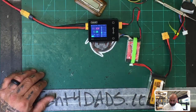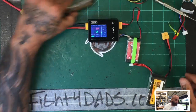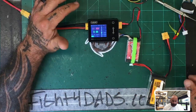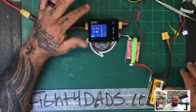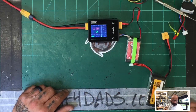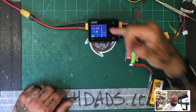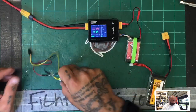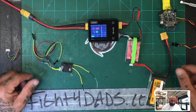While it's charging, one thing I wish they'd fix is the ability to use other functions while a charge is in progress — it locks you into the charging screen. We're at 76% and climbing well at 1 amp. I'm pulling about 30% more amperage out of my AC-to-DC converter, which is fine. Running at 12.01 volts. We're almost one minute in. Temperature is at 44 degrees Celsius. What I want to test next is the FrSky receiver feature — that's pretty cool. We've gone up 10% in one minute.